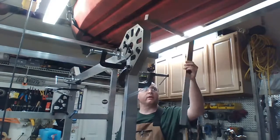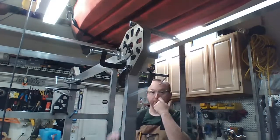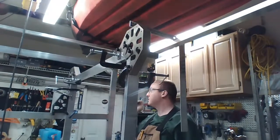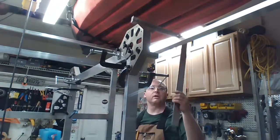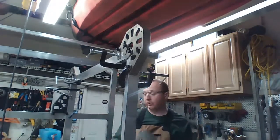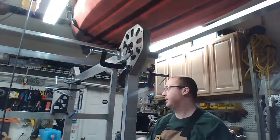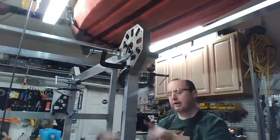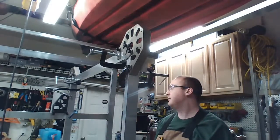Take a large framing square, set it to the outside, measure over, move it down, because I already have this beam across the whole thing. So that's a good square to go off of. Okay, so anyway, I'm going to try to get this thing square first, side to side, and then I'll get square forward back, check my diagonals, tack it in, keep going.